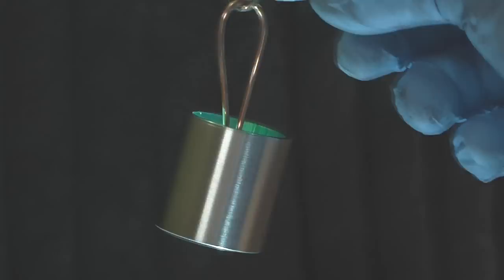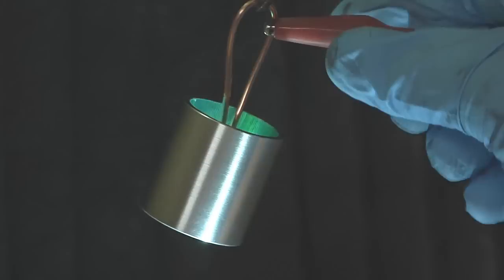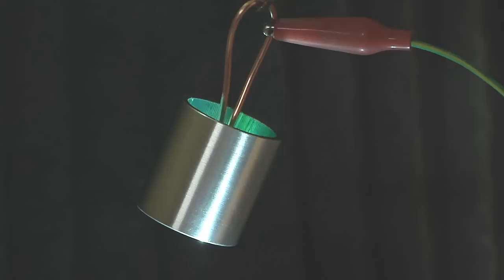Once you've got the part suspended, you've got to hook up the ground lead that comes from the powder coating gun to it. Now, a part like this, I can probably just hold on with the alligator clip, but I will continue to do it inside the booth here, just to give you an idea. So now I've got the gun,